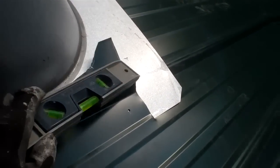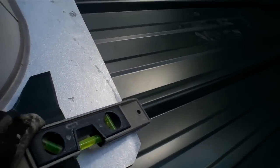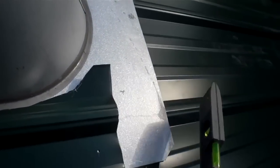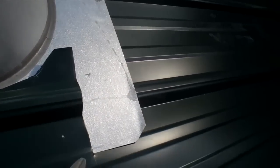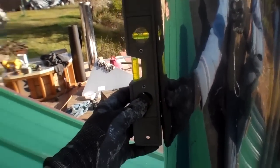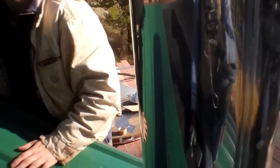You also need to make a simple slit on both sides so that the bottom edge of the flange is flowing out over the steel roofing, to facilitate all your water to flow over the steel roofing and not underneath it. Remember to keep it plumb with your level before you screw everything down. That's it for Obadiah's wood stove installation — thank you very much.